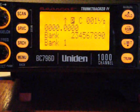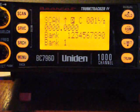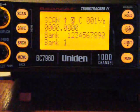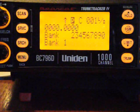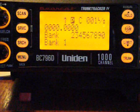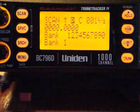I've changed the angle slightly so you can see the screen. It's been wiped clear and it's just sitting doing nothing right now. It's on channel 001, mentioning the priority channel, and the 10 banks are all opened up and ready to go, but it says channel 001 is locked out. I'll now proceed to put in the two frequencies in channels 1 and 2.